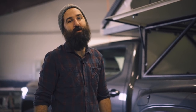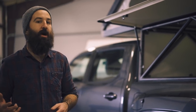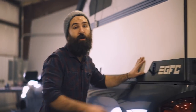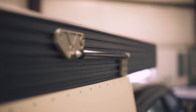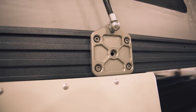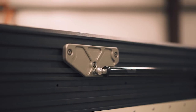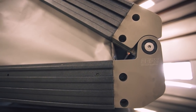The GFC platform is built almost entirely in-house. We do all of our own welding, plasma cutting, tube notching, sewing — basically all here in America. We make a lot of billet CNC machined components all in our in-house machine shop. We also have an anodizing line here. We have our own proprietary extrusion that runs a triple T-track down the side so you can mount accessories. Basically all billet machine components — these exterior hinges are billet machined, these extruded rails are powder coated, these end caps are anodized. Basically mitigating any sort of corrosion, improving wear life and aesthetics. Really, really high quality components, so no stuff to fail over time.